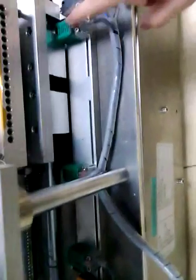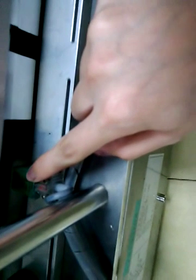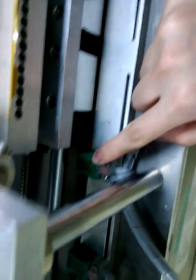Then it is done. And this can fix the height of the silicone roller, just like this. This is the silicone roller, and this high one can fix the height. As you can see, here there are 3 buttons, 3 connectors, the green one, and the middle one can also fix the silicone roller, just to prevent the flex cable from roller damage. If you want the silicone roller to go more forward, then you can put it to the left one. Okay.